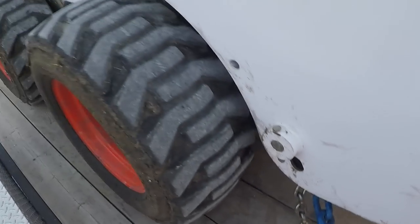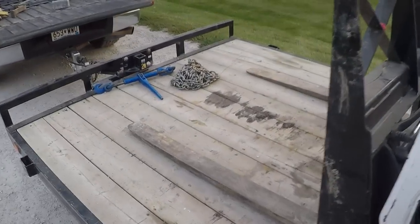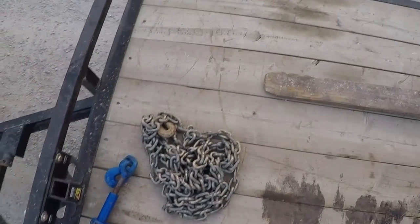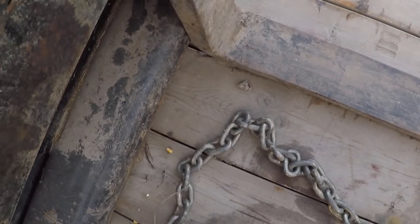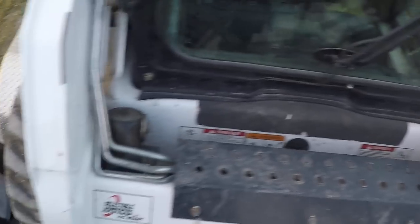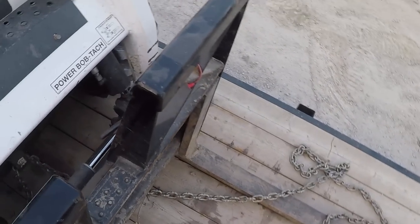The other thing — when you're doing these tie-downs, you've got to have the front one hooked up, because you can literally slide the machine on the deck. If you get the front one tight, they'll pull against each other and lock up before you run out of binder. I like the ratchet binders. The reason is I don't want those flip-down binders hitting me in the face — I've seen some messed up pictures of guys taking those to the face.